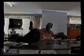There was a chappie recently, about 2.5 years ago, cleaning windows at Russell offices, the army buildings there. He's coming down, and they were using stop descenders. Are we familiar with what a stop descender is? Press the handle in, you go down, let the handle out, you stop. They also had, on a cow's tail, a mechanical ascender to a second rope, so it's pretty much a fail-safe system. They also put stopper knots in the ends of their ropes, so that if the rope was too short for the building, you didn't abseil off the end.